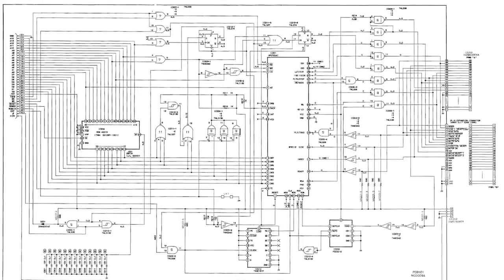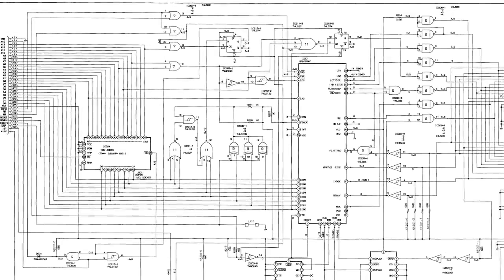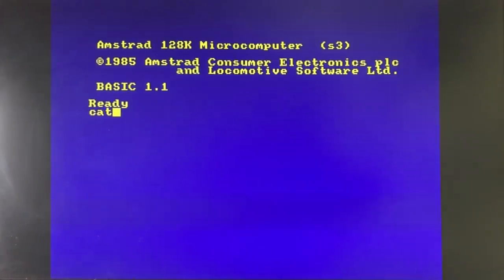Since I didn't see anything really obvious, I decided to take a working Amstrad CPC-6128 from my collection, remove the floppy disk controller, turn it on, try to access the disk - and same thing. The screen was filled with the same pattern. So I must have misremembered when you get the bad command - maybe it's only when you get a bad ROM, or maybe it's a faulty floppy disk controller but not completely dysfunctional like this one. So now we know that without a floppy disk controller at all, you get the full screen filled with that red pattern.